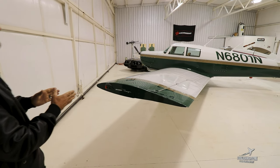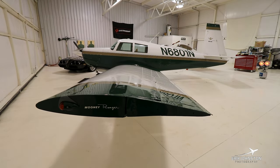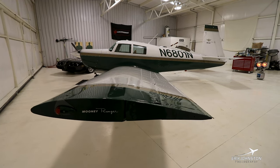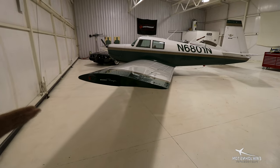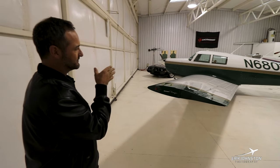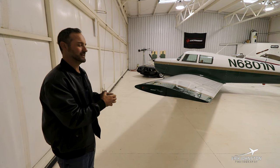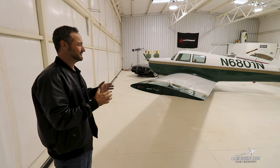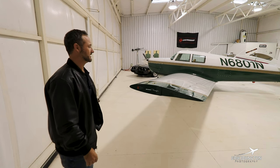From this angle, you can really see the middle post — the B post — which is actually where the space frame has a post. In the J model they actually removed that, but it's present in the G, F, and E models from that era. What that does is keep the center of gravity very condensed and contained. The Bonanza is another aircraft where the aft CG — the pilot is really the only thing forward of the spar. Same with the Cherokee 6 and some other aircraft.